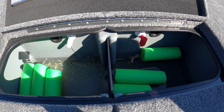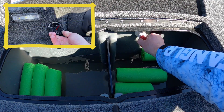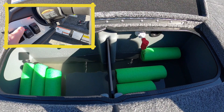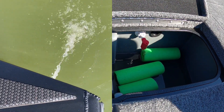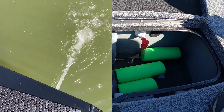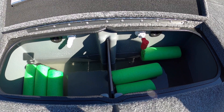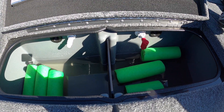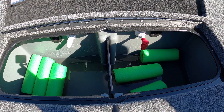Now if you want to pump the water out of your boat, make sure it's in the closed position. Grab the red nozzle and pull it out. Make sure you hit auto and then the water will start pumping out the back of your boat. If you fish tournaments this is a pretty useful way to fill up your weighing bag at the end of the day. You could also use this if you just have too much water in your live well and you want to get it out — it's another useful way of the pump out feature.